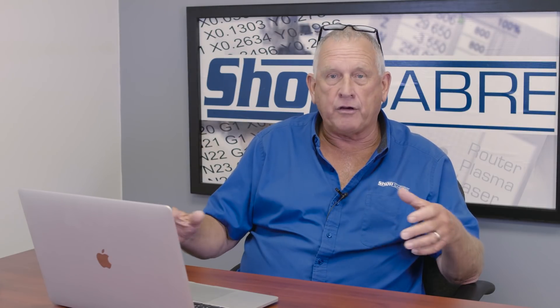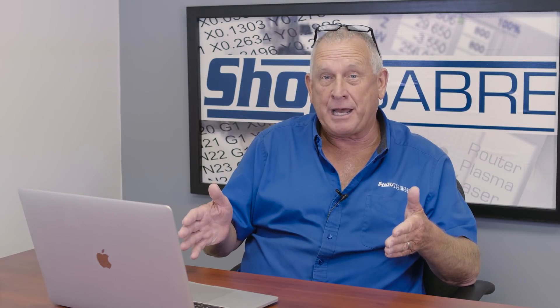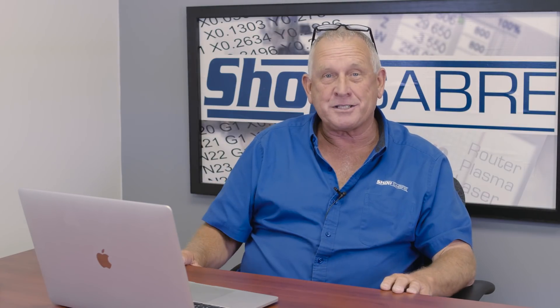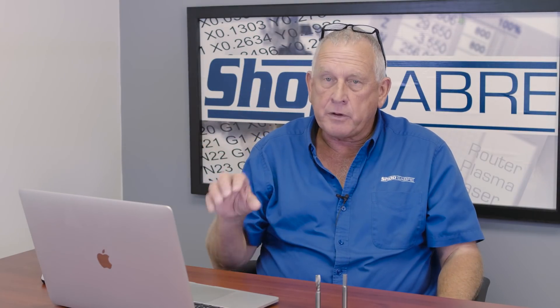What I want to do in this video is first give you a little overview of how you tool plastic, and then we're going to do a direct comparison of the finishes produced by the standard plastic tools and the polycrystalline diamond tools. We're going to start out with a piece of acrylic plastic that's a half inch thick and roughly 12 inches by 36. We're actually going to cut two rectangles, making them a little bit smaller so that the parts are held in by a skeleton, because we want the cutting actions to be as equal as possible.